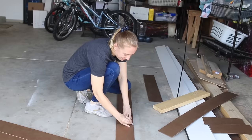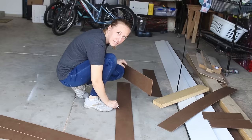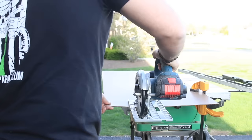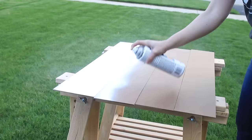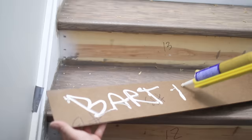I started working on the risers by ripping the hardboard down to width, and then my partner jumped in to help cross cut all of them to length. This can also be done with a circular saw; however, the edges are not as sharp as you'd get from a table saw, so a little hand sanding with 120 grit will take care of that. Then some primer action with the same Zinsser primer and we're ready for installation.